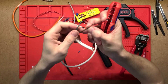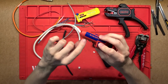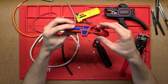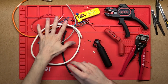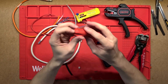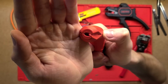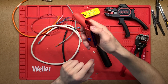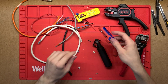What I have found with this one is it tends to work for bigger cables — anything pretty much above that 0.5 or 0.8 millimeter works pretty well, but the 0.2 and 0.3 just don't work all that well for me. This really is meant for electricians or when you're working on thicker cables and 240-volt cables. But really nice small form factor, super lightweight and really nice and sturdy. This other side is also spring loaded and has a thinner diameter cable slot — it's made for coaxial cable. If you're working with coax or anything to do with antennas or signals, this side will be very handy. You just flip it and you've got that same sort of operation. Love this thing — absolutely awesome. It's not that cheap but it is very worth having.